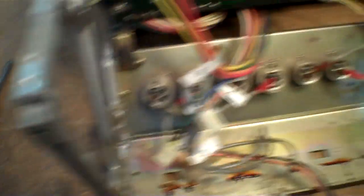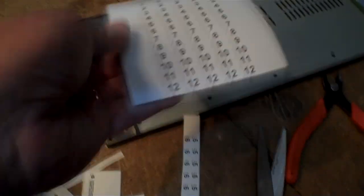All the wires got tagged with numbers corresponding to the board layout. This shows all the connectors where they're located. I made a sheet I could use to tag the wires. Now that this is out, you can see more of that goop — a little easier to see. I'm going to use some water that's been filtered with this big Berkey, and also this electric water pick for the final rinse, and of course a brush to get started.